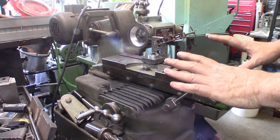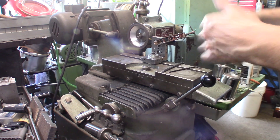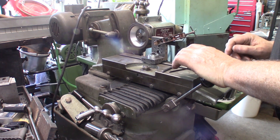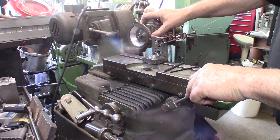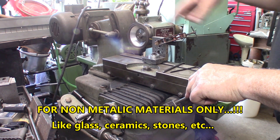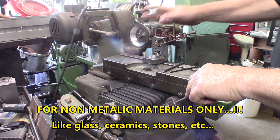This is the setup I'll be using for the grinding. Having a tool grinder will produce a better, more stable grind, but it can also be done by hand — I've done some with very good results also. This is the little diamond bond resin grinding wheel. One note of advice: do not grind high-speed steel or any steel on these wheels. It's not meant for that. It's meant for carbide or very hard materials.